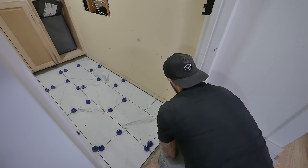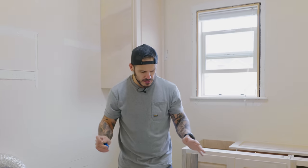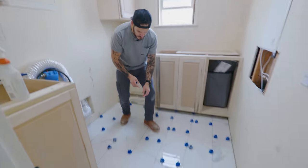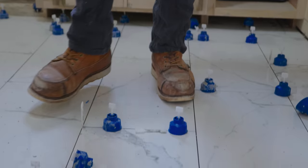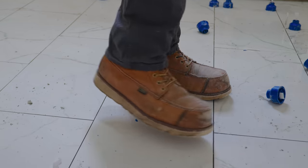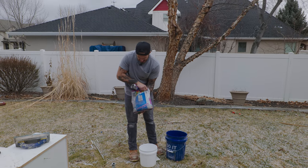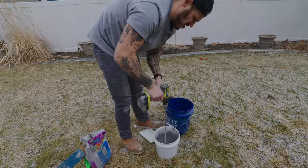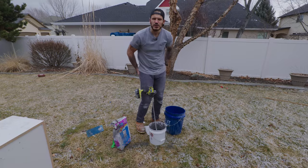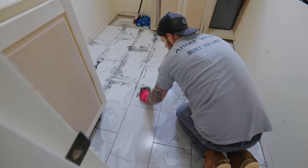It's been one full day. The tile is all cured. I'm a huge fan of this Marshalltown Fast Cap System — probably the best tile job I've ever done. To pop the leveling clips off, you just kick them in the direction where the flap is set up — if the flap is sideways, kick it that way. It's officially grout time. We're using this sanded mix — you can do a joint as small as 1/8 inch up to 5/8 inch. Once it's mixed up, use a grout squeegee to push it all in place. It's like 28 degrees outside and my hands are freezing, but let's do it. We'll let it sit for about 15 to 30 minutes, then start taking a sponge and cleaning everything up.